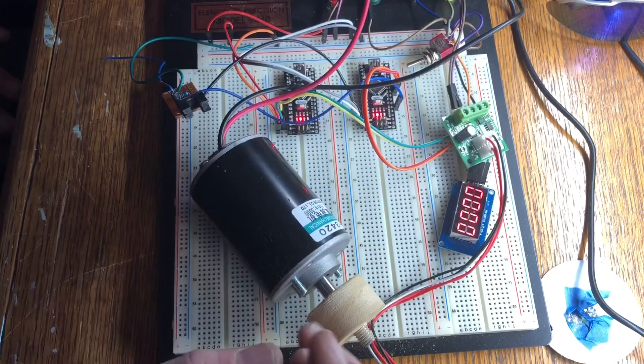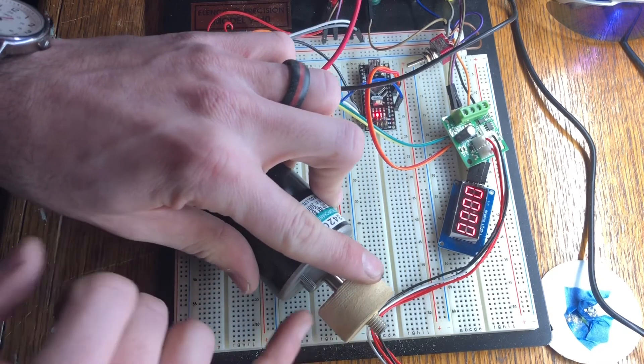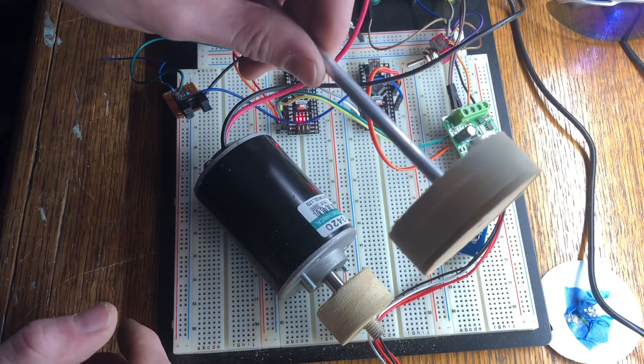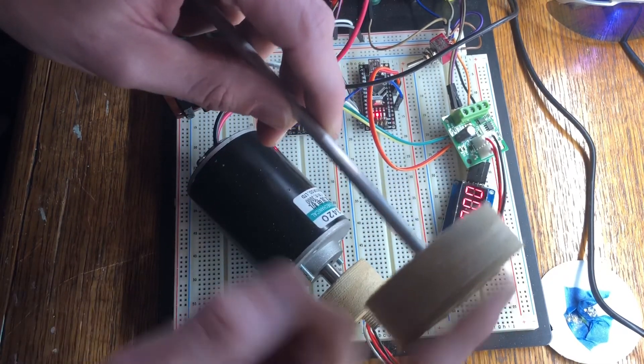Now I hadn't decided whether I want to use a flat belt or a round rubber belt. If I use the round rubber belt, I can just cut a little v-groove in here for it to ride in. So this is basically how it's going to be set up — if you imagine that rod goes all the way through there, I'll have this pulley close to this one, connected with a belt, and this will spin off of that. The size of these pulleys should slow down this rod from 3,500 RPM down to around 1,800 to 2,000 RPM. More than likely I'm just going to use the circular belt — all I have to do is cut a v-groove in here, and it seems a lot simpler than using a flat belt which would require grooving out all of this area.